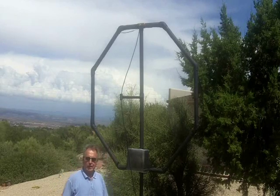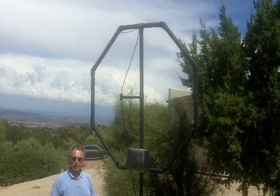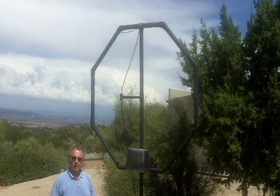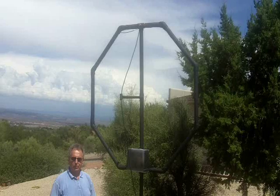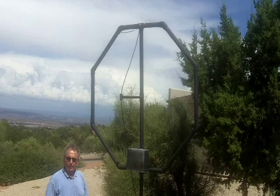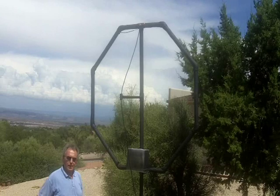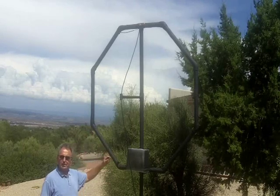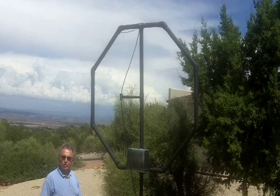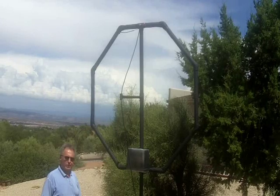The main difference with this antenna, which I call an HL magnetic loop — standing for helically wound or helically loaded magnetic loop — is that this loop is about 40 to 50 percent smaller in diameter and seems to achieve the same efficiency and operating characteristics as a loop that is six foot in diameter, which would have to be about 15 foot in diameter to produce the results it's producing on both 80 and 40 meter bands.